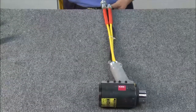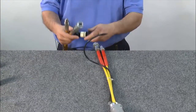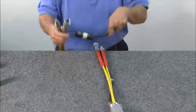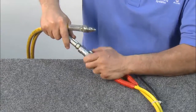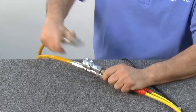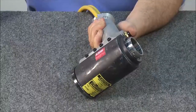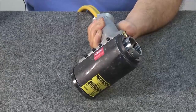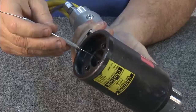Next, check for hydraulic leaks by hooking the tool up to the power rig. Plug in the electrical connector and plug in the disconnects. If hoses or electrical connections show wear, refer to the manual for replacement. Now we're ready to cycle the tool and check for leaks, checking the front and back of the tool carefully.